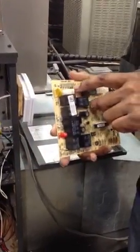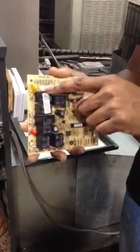This little two-prong right here is the 110 volts that your inducer and your igniter are going to get their voltage from. It's 110 volts at this prong right here. That's pretty much all my terminals on my board.